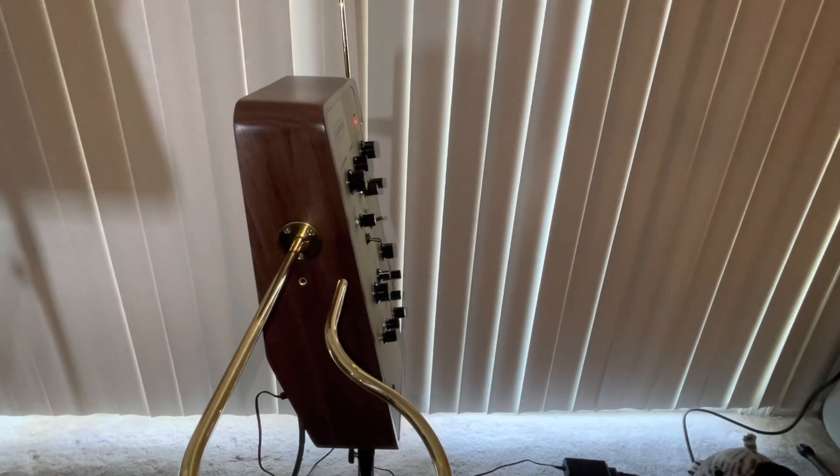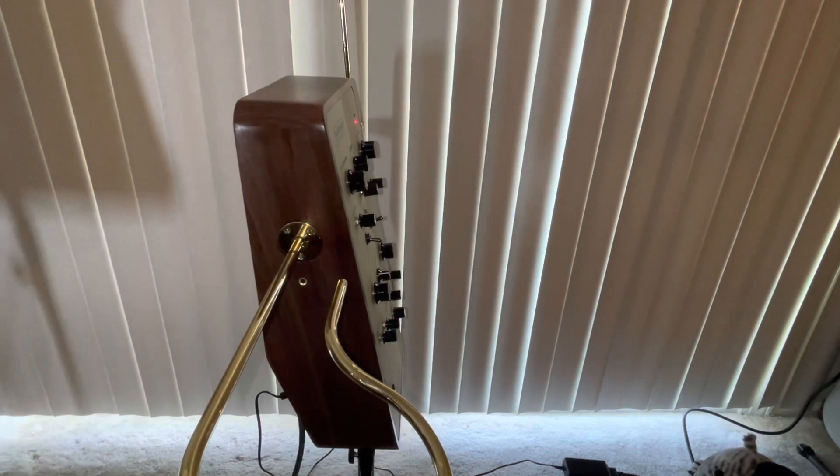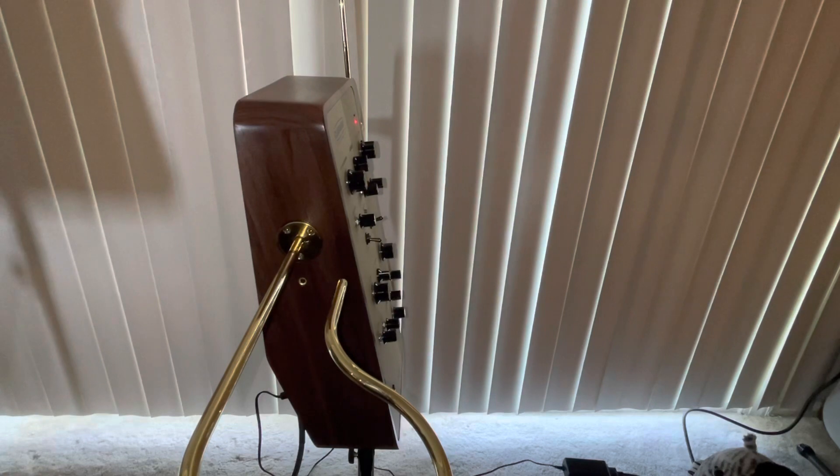One last thing: I am nearly certain that Moog is using other antennas — not the ones they ship with each instrument — to test these at their factory. The reason I'm saying that is because this antenna did not work as shipped; there was lacquer on the end. I was aware of the lacquering situation because I happen to be a musician. I've played professionally on and off all my life — I'm a classically trained bassoonist, a woodwind player. All brass instruments have this kind of finish to keep them looking pretty and shiny. So I knew there was a lacquer coating on it the minute I saw it. That is how we solved this problem, and I strongly suspect this is what's causing many other people's problems.